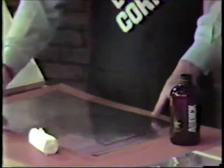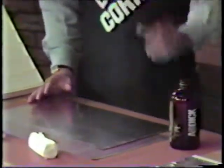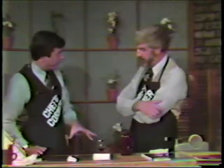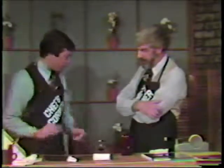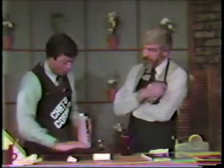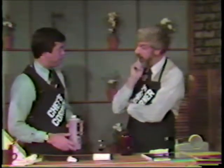Right. And it is then going to give me longer length of run, off to the offset duplicator, the 375, whatever, and run the material. When I'm done and I've run down the plate, I can store this plate by coating it with plate gum, or offset gum, which you just wipe on, store the plate, and wash it off with water. All right. And that's the whole cycle. That's the whole cycle. That's pretty simple.